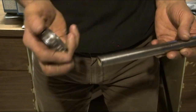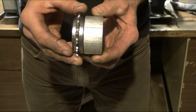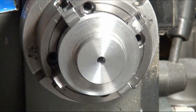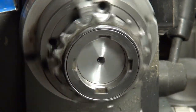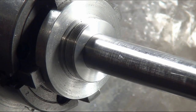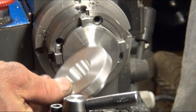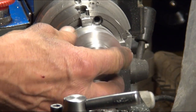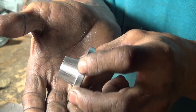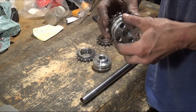For the pedal drive mechanism, I needed to attach a one-speed freewheel to a shaft made from a gas pipe, using a chunk of aluminum which I turned into a freewheel hub with threading. I bored it to fit around the shaft and gave it an internal taper, and made another piece with a cone wedge that fit that taper. Once slotted and screwed to the hub, the cone would flex and clamp to the shaft solidly, anywhere the hub aligns with the chain.